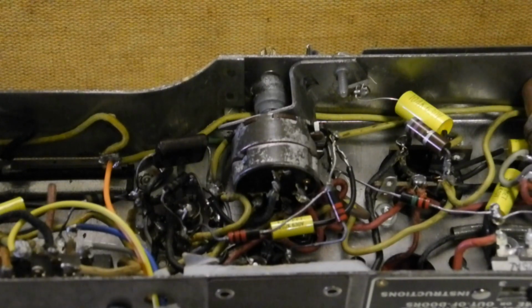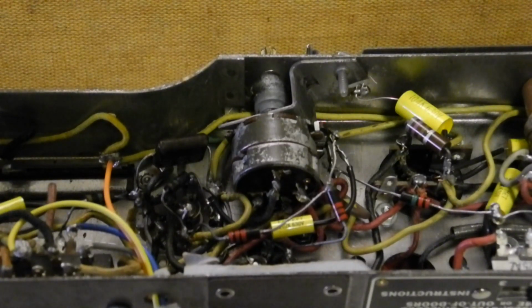The switch on the volume control was not working and was permanently in the on position. It's an unusual control with a double pole single throw switch which is unobtainable anymore, so I decided to simply live with it having the radio always switched on.